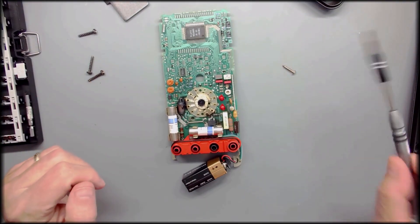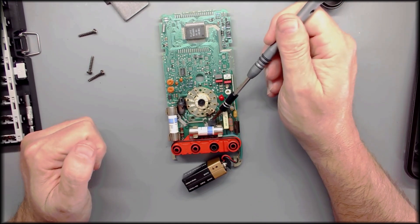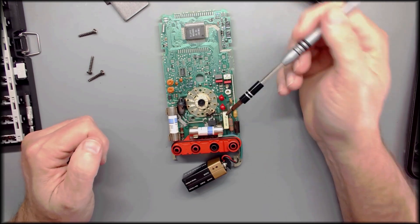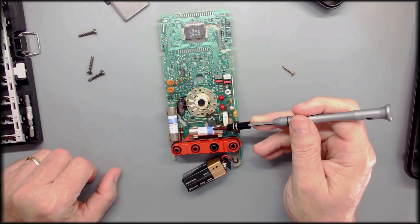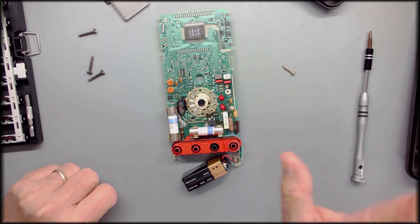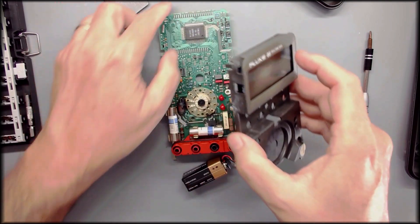Hello YouTube, RJ. I thought I popped a fuse in my Fluke 85, but as you can see here, it looks like I've done more damage. This chip right here was blown up — I had to replace it. It's a rectifier, and you can see how burnt that resistor is. This rectifier I happened to have in stock, so I lucked up. So I replaced it and the fuse, then put the unit back together, and it works without any problem at all.